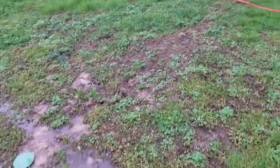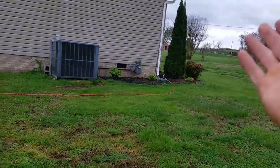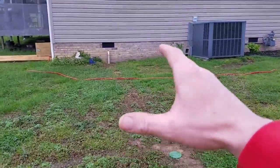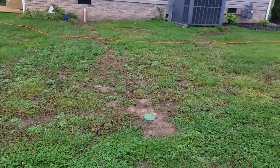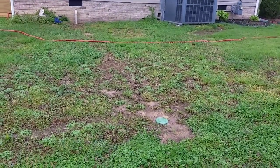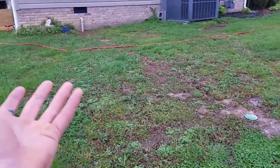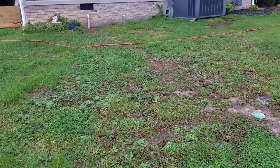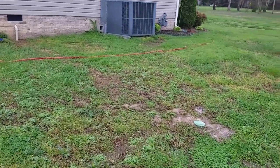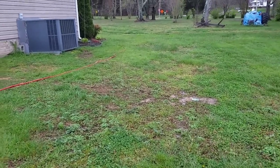And guys, once again, just so that most of you know, it's going to depend mostly upon where you live and how the conditions are with the water table flowing to and from your house. But most sump pump installations, like what you have seen here, that pump's not going to be kicking on very often at all. And within that basin area, I set that float valve just a little high on purpose because I don't want to set it so low that as soon as a little bit of water gets in there, it kicks on. I don't want to kick it on all the time for the people. So I try to be sure to set that float valve so it has a little bit of room for play. And I always like to check everything before I consider what I have done complete.